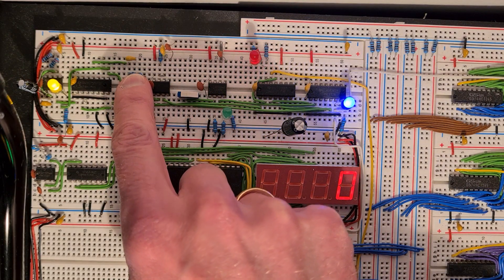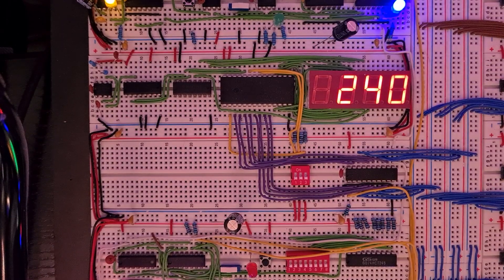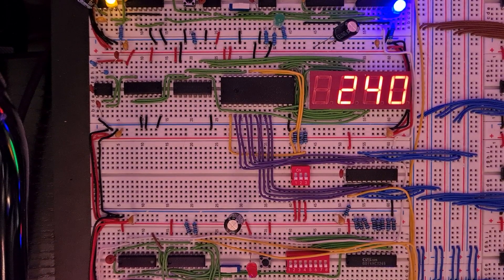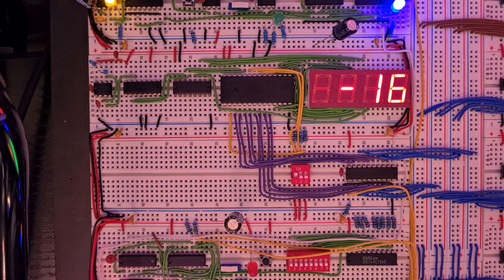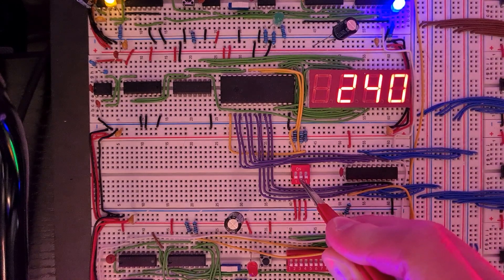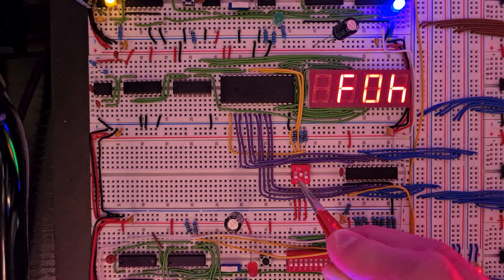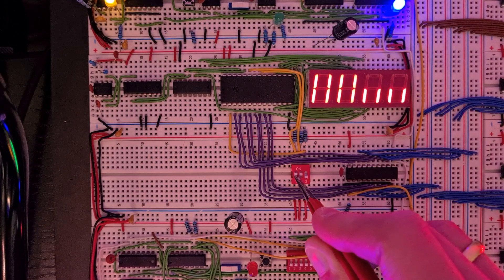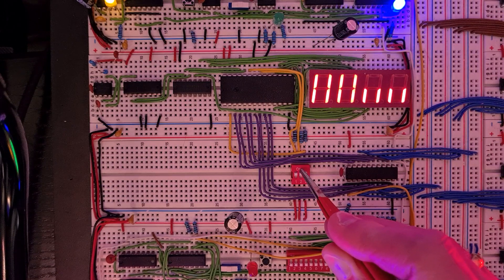The clock runs at a fixed speed of 1.8 megahertz. Ben Eater's computer has a seven-segment LED output display that I use primarily for debugging purposes. I also implemented the feature to display the value as a negative value in the range from minus 128 to 127, or as a hex value. I added the feature to show that byte as a binary value, where the longer lines are ones and the shorter lines are zeros.